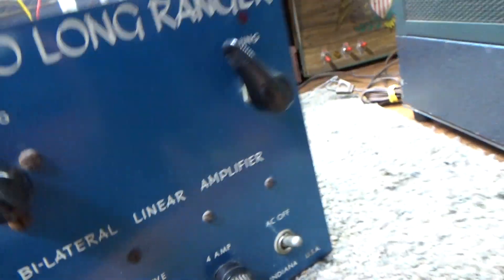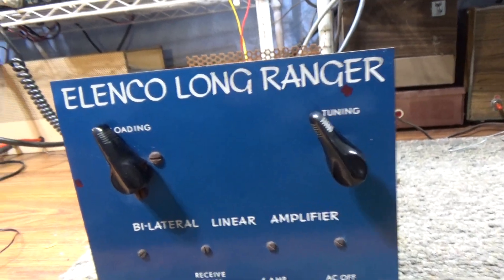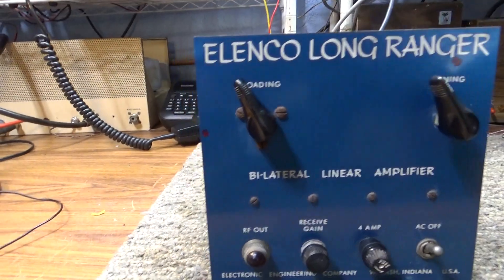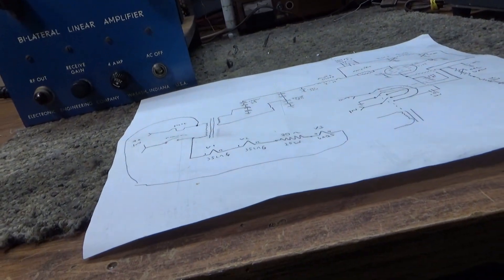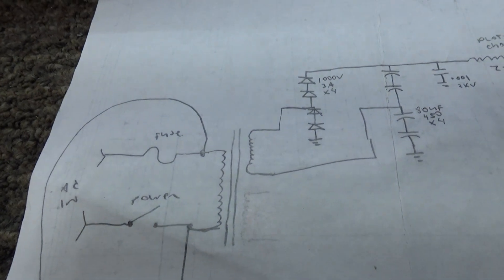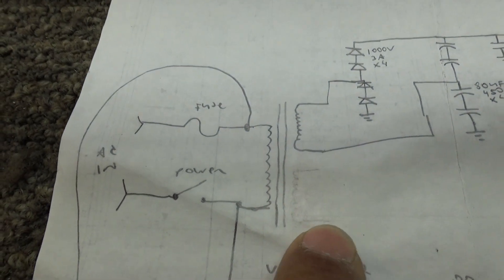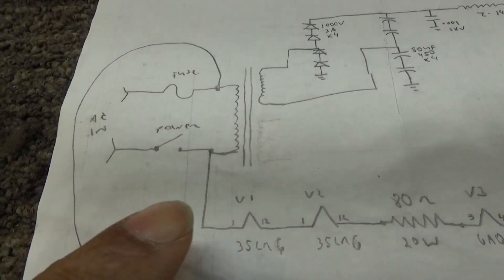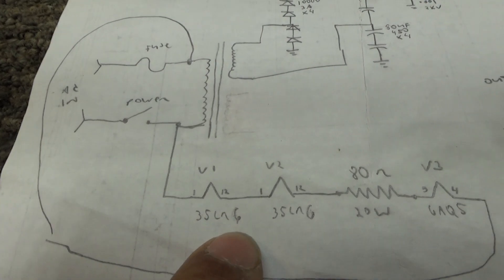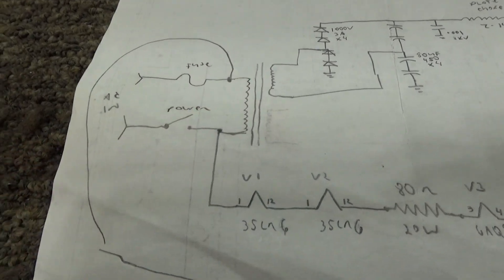People tell me it works — the designers did it and it works. Yeah, it works, but it's a shortcut, a cheap way to do it. They're trying to make money so they can do it cheap instead of getting a transformer. Part of that schematic I wrote out — instead of getting a transformer with a filament winding, they just take one AC leg coming in through the tubes, then through that resistor, through the other tube, and back out. They take it right off the line.